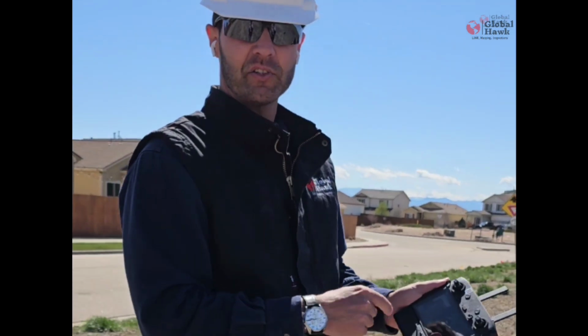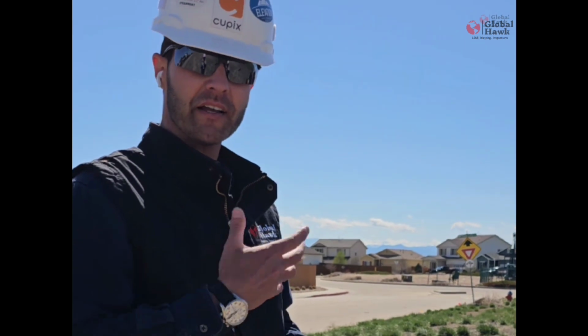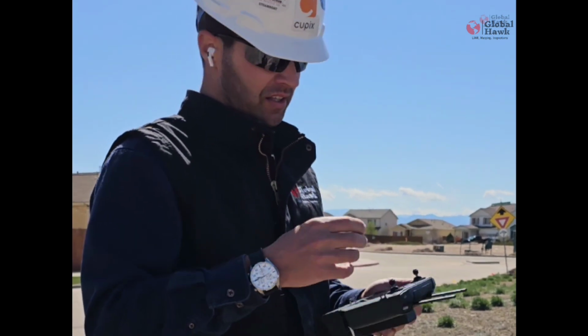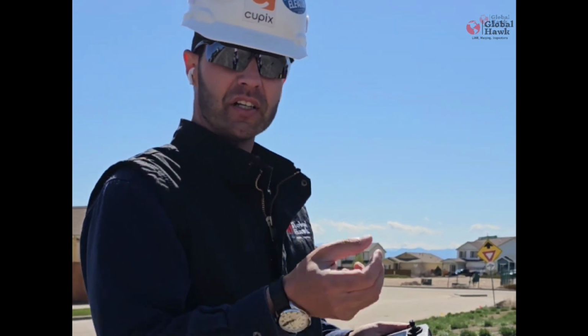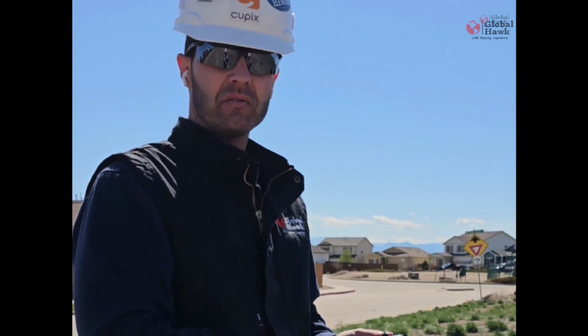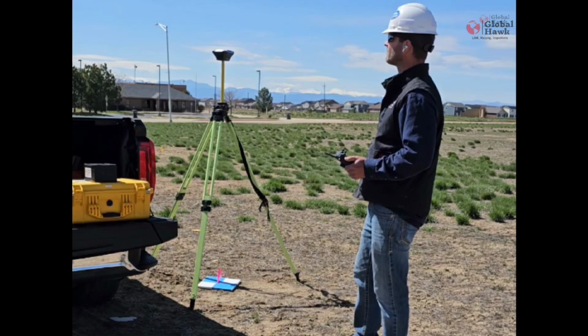After we see it fly its 2 figure 8s, which is a separate mission, we're just going to go ahead and start up our second mission while the drone's still in the air. We don't let it fully return to home. There's no need for that. It's still recording data. So the minute that you see it finish and it starts beeping to return to home, stop the return to home, start your next mission.